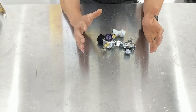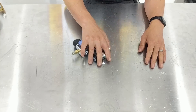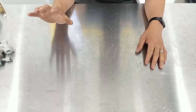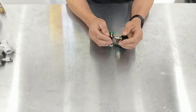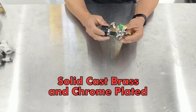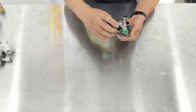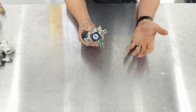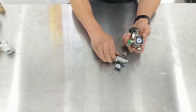Honestly guys, these little mini regulators are a thing of the past. They might be slightly cheaper, but I would just forget about these bad boys. We've got this type of mini regulator which is seriously awesome, and let me show you why. The first thing you'll notice is we've got a hex body, so it's easy to get a spanner on here and you can couple with a few different parts and twist it onto the gas cylinder and maneuver it. We've fixed that exposed gauge issue.